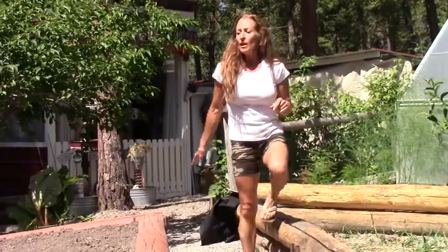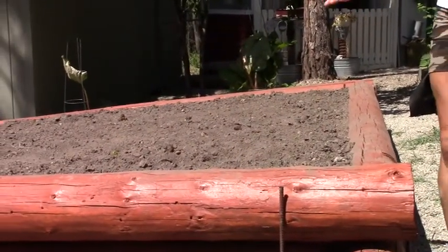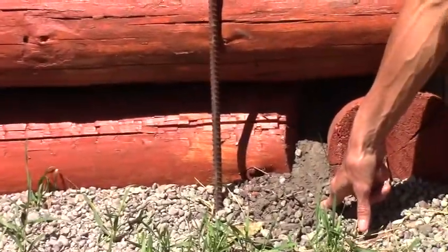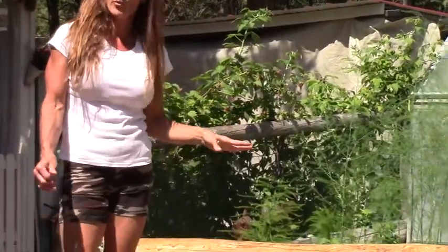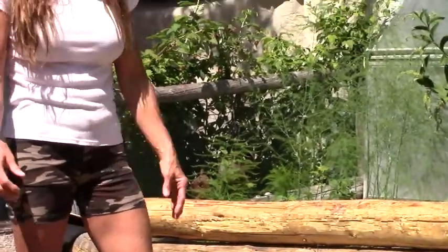With the straight lodgepole logs I have, I didn't have very big gaps. When I tested it by running the hose as hard and as long as I could, I really did not have dirt coming out of the edges — it just seemed to stick. However, you can see where the dirt did start coming out of the corners a little bit, so I'd recommend putting weed fabric or septic fabric in your corners. I don't really like using visqueen because it catches moisture and mold, so avoid it if you can. Most dirt has weeds in it anyway, so I'm just going to stain it, put some fabric in the corners, and put in my dirt.